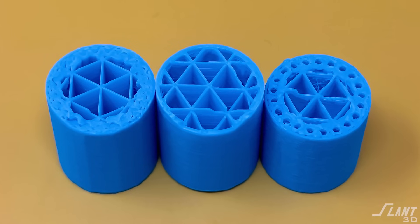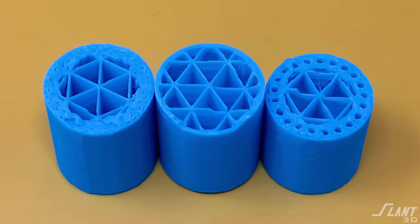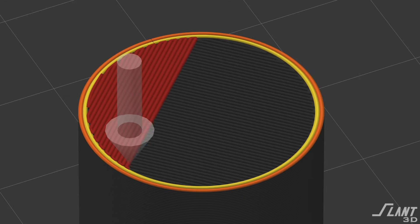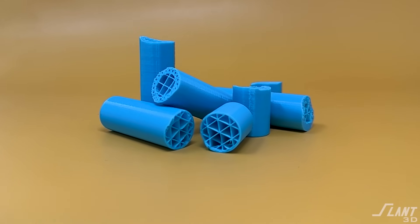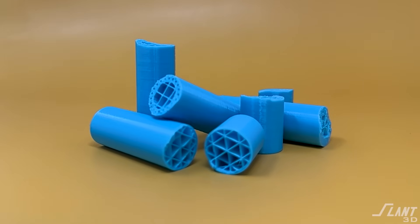You wouldn't have to say, I need the wall thickness to be four millimeters. You simply design in very thin features that are four millimeters thick and they induce that wall. If you get fancier with this geometry, you're creating a 3D printed rod inside of a 3D printed part, building up strength across the part without having to add additional features or worry about homogeneity. The easiest answer is just to do a solid infill, but when you want lightweighting with controlled strength in particular areas, you can introduce these microstructures which cause the slicer to put more material where you want it so that your part doesn't break anymore.